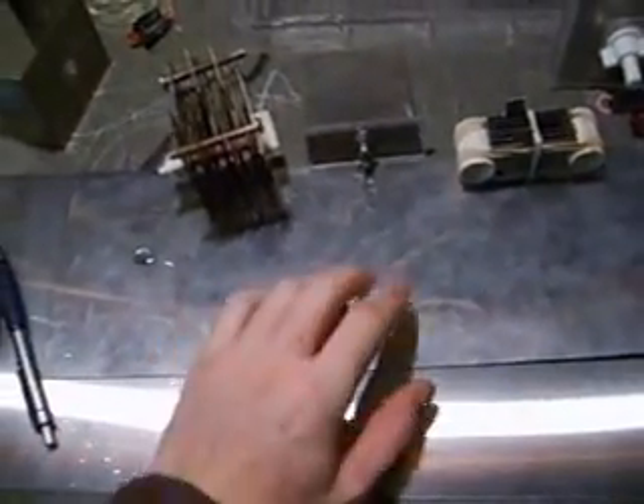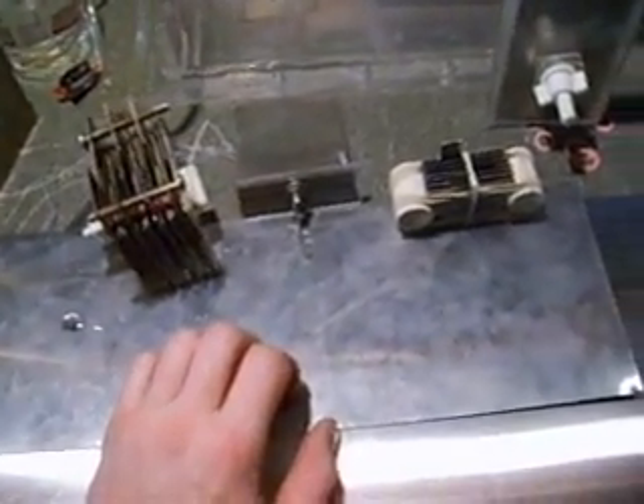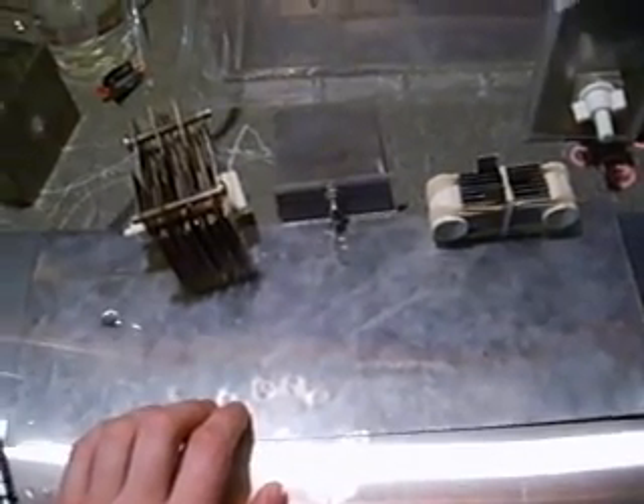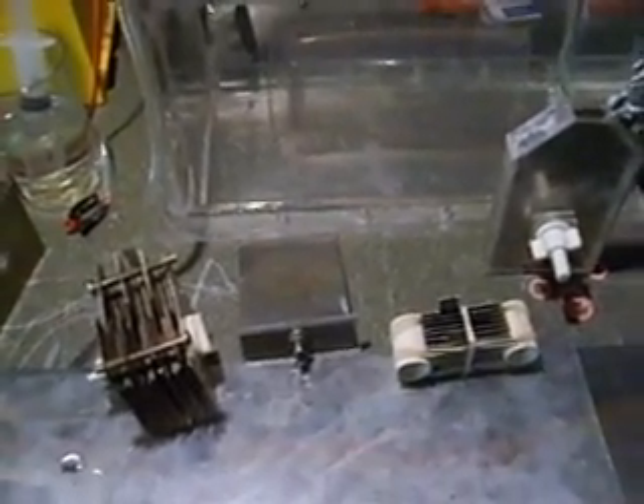This is something I've only just come across in the last day or so, and it's information that everyone needs to get out there. It's about a nasty by-product called hexavalent chromium. It's a by-product that has more to do with the stainless steel itself than with electrolytes, related to the way the stainless steel is made. This 304 stainless steel is apparently worse for it — it puts off more. 316L seems to be a better way to go. All of my current stainless steel is 304, and after one more cell to confirm a design, all my cells will go into retirement. All future cells will be made from 316L or something even better if it exists.